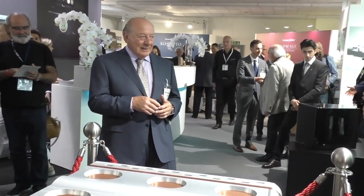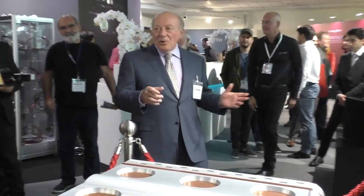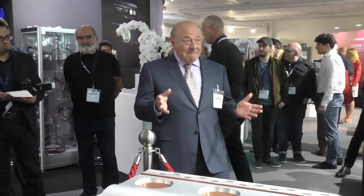So now we have an amplifier that has very low distortion without global feedback, because all of the distortion products are mixed together with the negative and the positive, which are exact reciprocals of each other, and they null out all the distortion products. So this at full power is 0.006. The Momentum's 0.1, which is marvelous, and this amplifier would be 0.12 if it wasn't a perfectly balanced amplifier. We do not have global feedback, so there's no way to change that. That's what we get just by adding the 2 sections together. We also get incredible signal-to-noise ratio and incredible dynamic range.